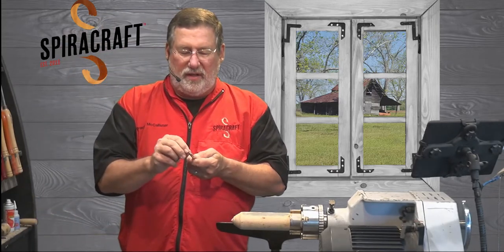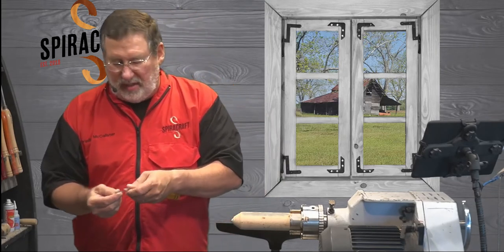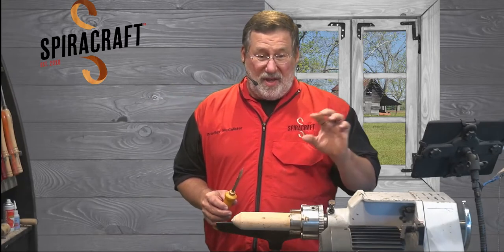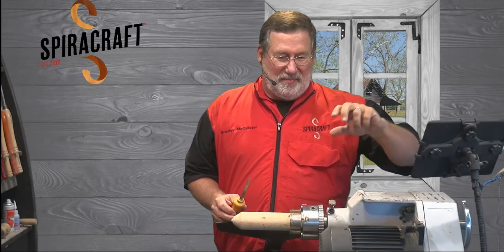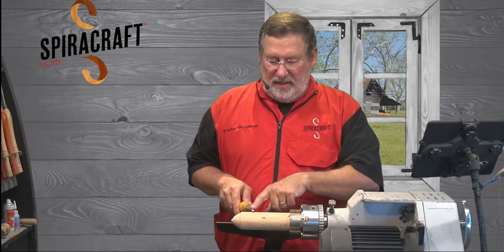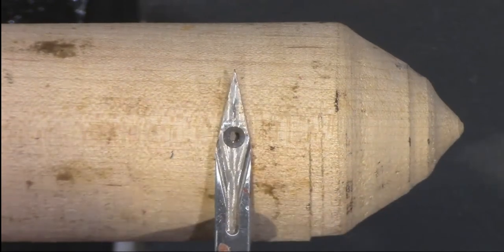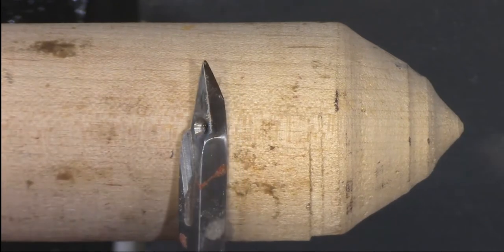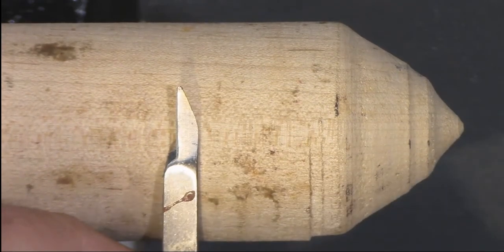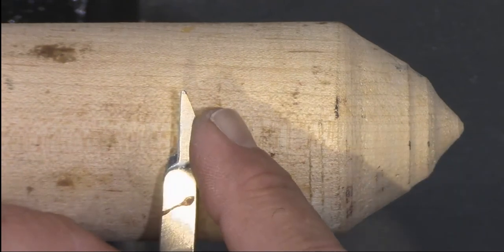This is the CI-7 with negative rake. I'm changing it out for standard cutters and keeping the negative rake ones for resin. Now, for doing these little miniatures — and this voids the warranty, Doug will confirm that — you can see I've ground some of this away to give me a little more relief on the tool. Not too much, but just a bit of extra room.